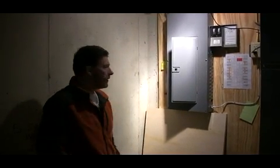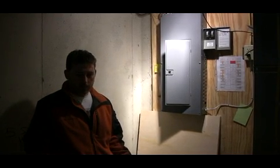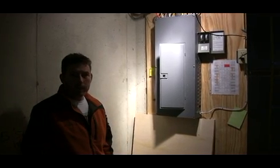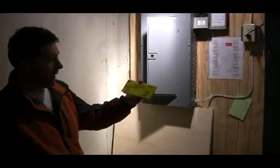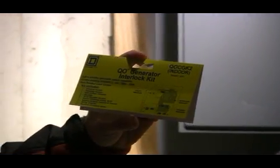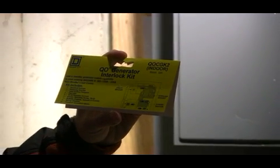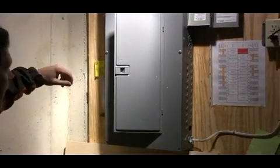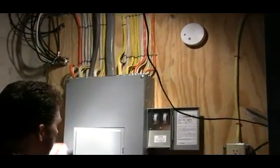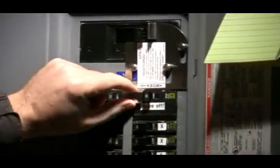The point of this was to show that there was an alternative to a transfer switch. Rather than installing a transfer switch that was expensive and limited your options for what circuits you could run, I opted for the interlock. My panel is made by Square D, so I got the interlock made by Square D — I have a QO type breaker system. I checked with the Maryland inspector, and as long as the interlock device is manufactured by the same company as your distribution panel, you're fine. It's UL listed and completely safe. The 10-3 line comes in to the top of the panel and feeds this breaker right here. It has to be in the two and four positions in the top right so that this interlock device will work.